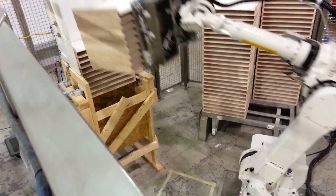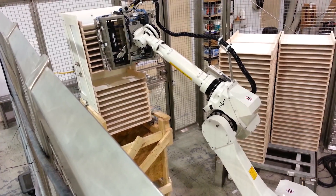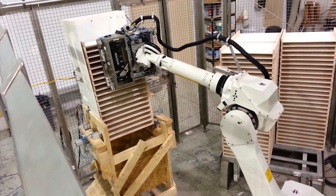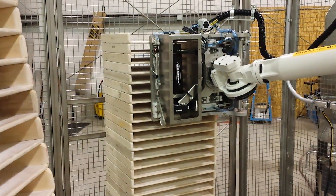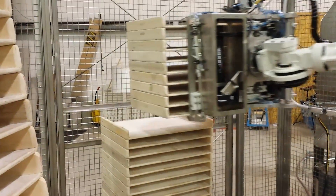When the operator rack has been completely depleted of trays, the FANUC robot will take product from the buffering area while the operator reloads another rack of trays into the cell. A light curtain located between the primary operating in-feed will isolate the in-feed and allow personnel to continually supply the cell with trays while trays are drawn from the secondary buffering station.